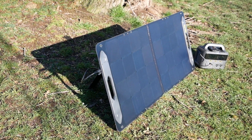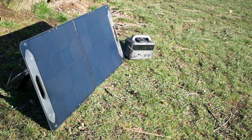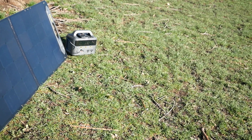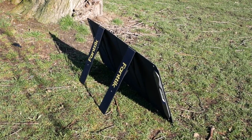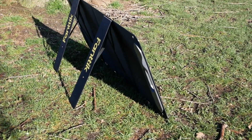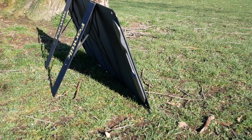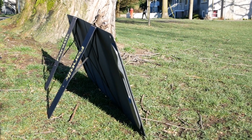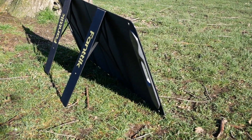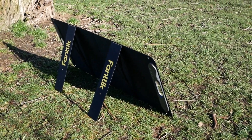The FANTIC 100W solar panel appears equally well designed. When you fold the panel, the two sides snap together by virtue of strong magnets, which are built into the sturdy carrying handle. One of the handles contains the Anderson output port. Magnets also hold the kickstands in place when the panel is folded up. Unfortunately they're not super strong, so the stands may swing open when carrying the panel. The solution is to strap the included cable bag around the panel for transport. You can use the grommets to the left and right of the handles to hook in a carrying loop, or hang the panel up. In its unfolded state, the solar panel rests on two kickstands held in place by partially elastic straps — a clever design, though it's the only part of the setup that doesn't feel particularly stable, and we're concerned the elastic strap will loosen and break down over time.